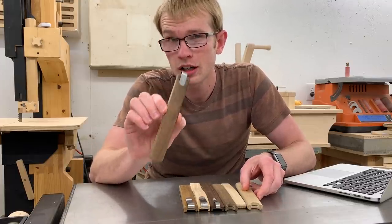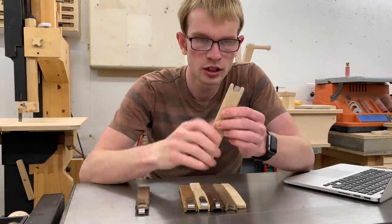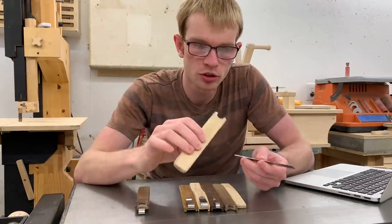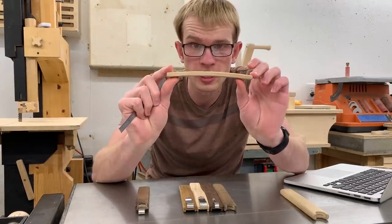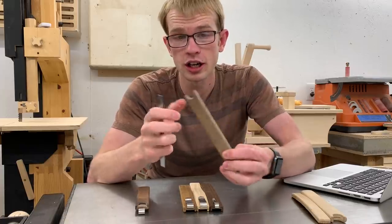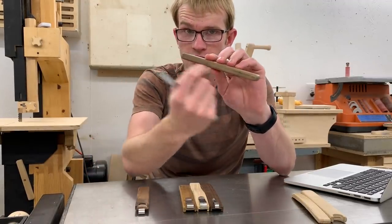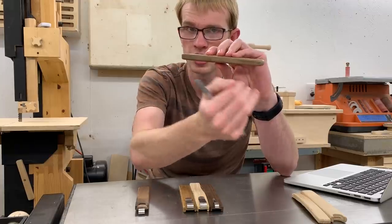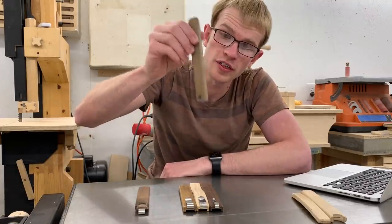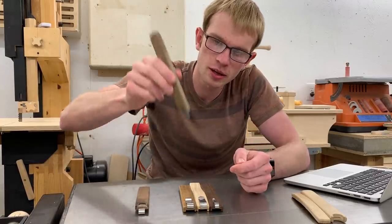In this video, I'm going to build a new one making a couple of slight improvements. This first one did not have a clip, and the main problem was it became loose after a while — I originally made the slot just thin enough that the rule was tight, but after a bit of time it became loose. Then with this one, I got the idea to put a curve in it and it totally failed because it's too tight. Then this was the second attempt at the curve, which I actually carried for a long time. It looks straight but it's actually got a curved slot inside — I cut this with the CNC router, one piece for the convex and one with the concave so they just fit together. With the curve in there, it can't fall out; it's just bending the rule slightly so even if it wears the slot out over time, it's still tight.